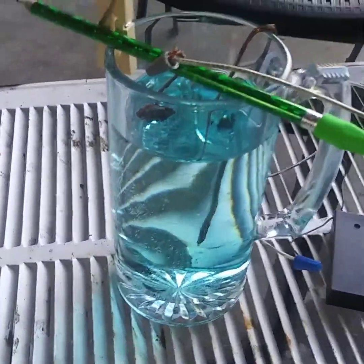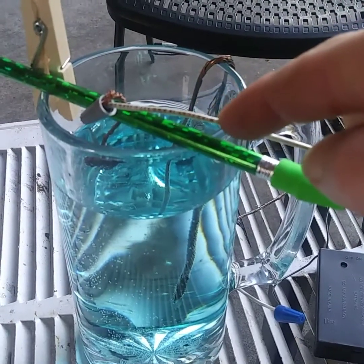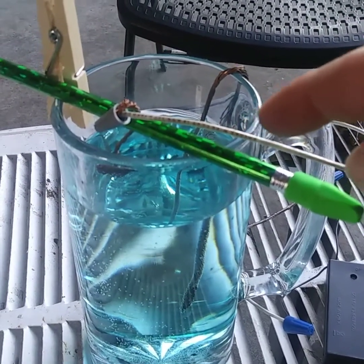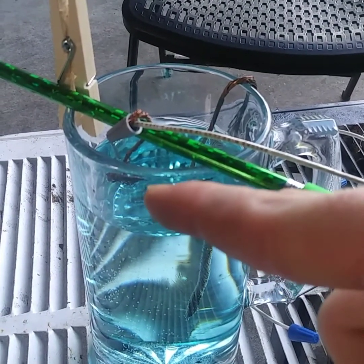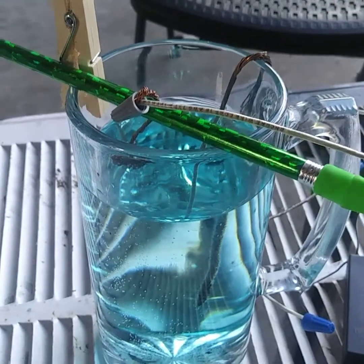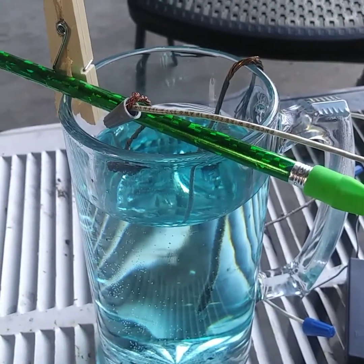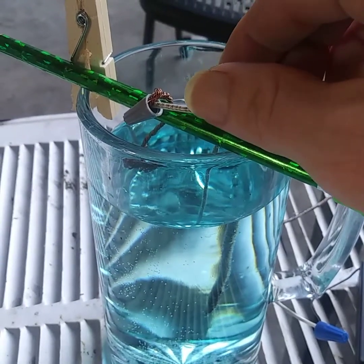Now then, for my test, all you're going to do is take your negative side loose, the one I told you was bubbling, and you're going to wrap whatever you're going to electroplate in a copper wiring. You leave it kind of loose, and you're going to submerge it as far away from the positive as you can get it. Now, this nickel's been going for about 20 minutes.